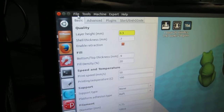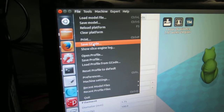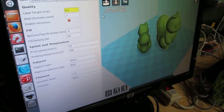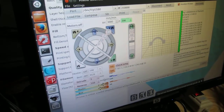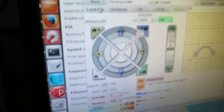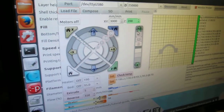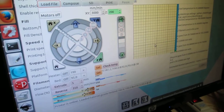Go up to the top of the menu — it only appears when you mouse over. Click on File, Save GCode, and put it somewhere you can find it. Save it as "tutorial.gcode". Then we go back to that Pronterface program — it's connected to the printer and preheating. Come up here to Load File, load the file, find it, type in "tutorial.gcode", and open it. It will show a preview.